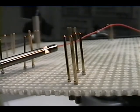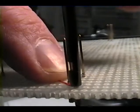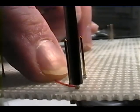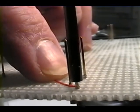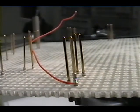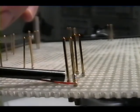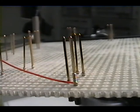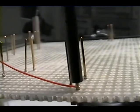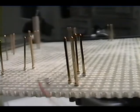Now you can see the wire is correctly down the spline of the tool. Reapply it to the post and turn clockwise, just allowing the weight of the tool to rest on the post — no additional force is necessary. The Radio Shack tool does not produce a modified wrap, which means below the conductive wire wrapped around the post there is no additional insulation. You have a coil of conductive wire going down to the bottom of the post with no insulation around it. However, the Radio Shack tool has the advantage that you can wrap and unwrap with the same side, so you don't need to reverse the tool to remove wire.